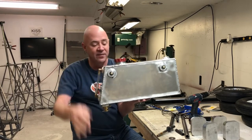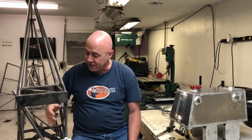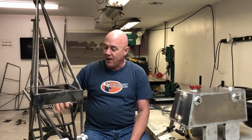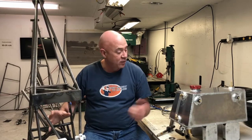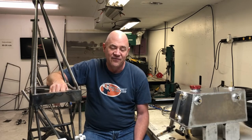This is my vent tube and right now the tank holds 4.1 gallons, so I'm 0.9 gallons short of the five gallon limit. The fuel tank fits in the nose of the air bike and that's the only physical size I could fit in there. It looks like it's going to be good for about two hours and 20 minutes of flying. If I fly an hour and 35 minutes, that's going to be plenty for an ultralight before going back to get more gas.